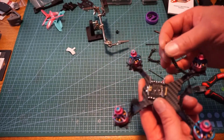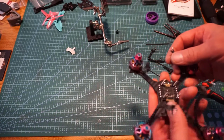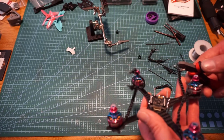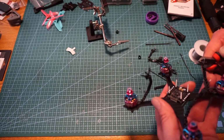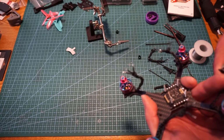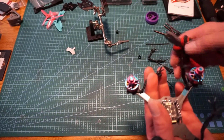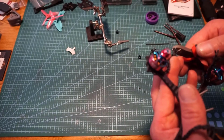I cut them right around 3/16 of an inch when I pull the stuff off of them, and then I just turn around and I cut them back about halfway. That way there's not too much exposed. I cut them extra because I heat them at the tip, and then I let the solder flow back down. If you get it too close to the wire covering, you can fry it.